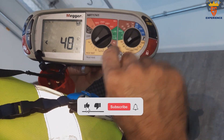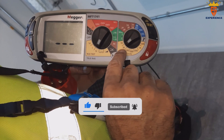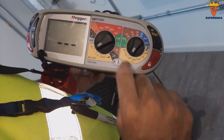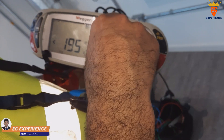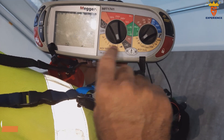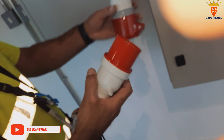At 30 milliamp, times one is a standard test; times five is 150 milliamps on the 30mA setting. Times one at 100mA, times five at 100mA. This one here is a ramp test — if I press this it tells me at what level the RCD trips.